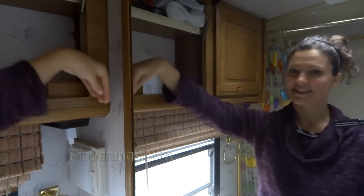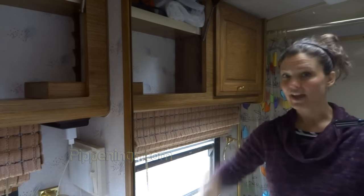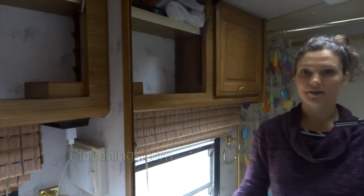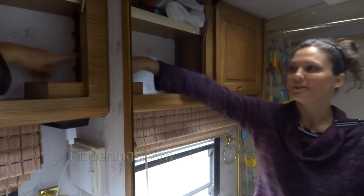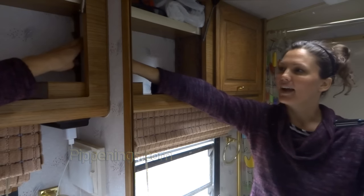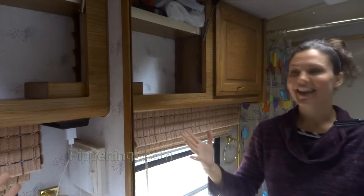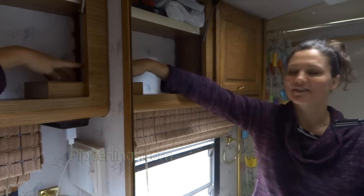So I am here trying to figure out, can I put a hole through this and access the raceway where all my other electrical cables run? Then I can match that into where the other cables are going, where there are already holes drilled down into the bin. So my first thought was that is roughly right around here, and I'll just knock a hole out in the wall here, and then run a snake down and see if I can find where it's going. But when I opened this, of course, there are always more things that are going to get in the way than you anticipate.